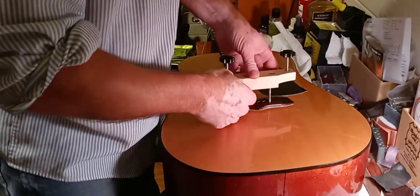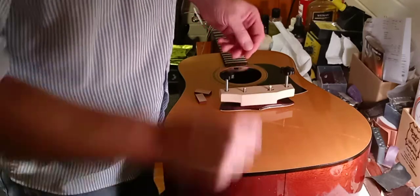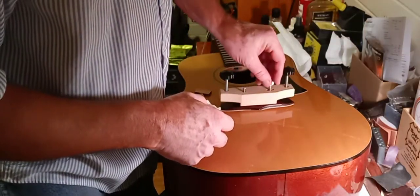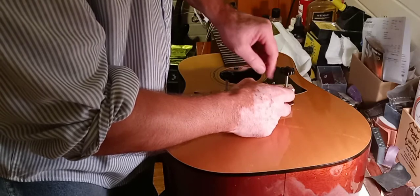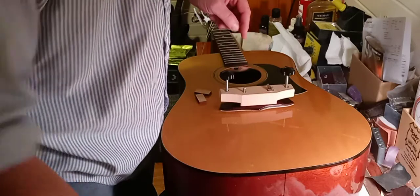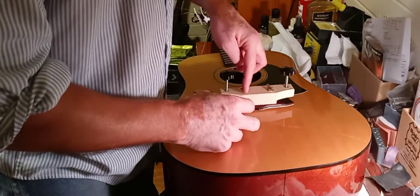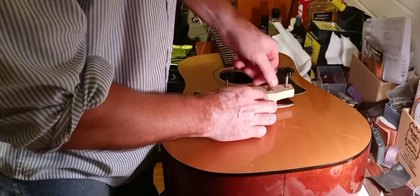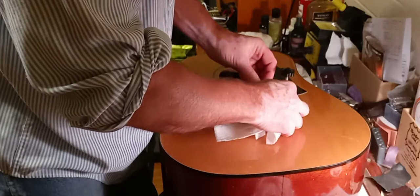Now you just take your tool. One of these is slotted to give you just a little bit of leeway. You set it down on there, take your wing nuts. Now if I can get my wing nuts started — there we go. The only thing I should improve on is I should have flat washers under these wing nuts, but this is maple, it's really hard. You don't want to tighten these bridges down tremendously — you want to get them down snug, but you don't want to get it so tight that it's going to push all your glue out. I have seen folks really torque those things down and squeeze all your glue out.